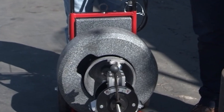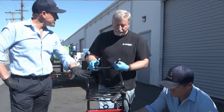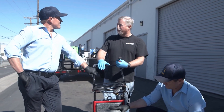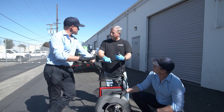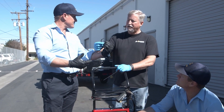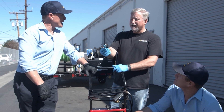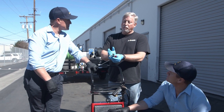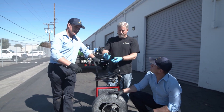John is using a Dura Cable DM-162, which has 100 feet of 5/8-inch cable, made in Des Moines, Iowa. This represents a typical plumber showing up to do snaking. He's using a double blade — a typical 2.5-inch round blade, which is common and has saw teeth. On the topic of leaders: a leader can help negotiate turns like going through a closet bend, but John prefers going directly on the end of the cable. He'll only use a leader if he needs to put a bend in the cable without bending the main cable itself.